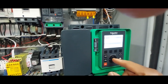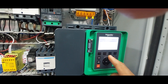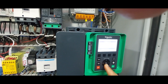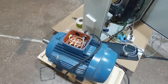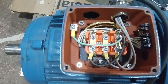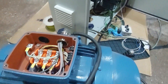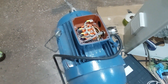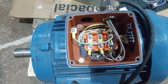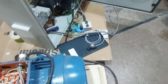We're going to run this on a start-stop configuration, so I'm going to configure the inputs and I/Os. For the motor connection, I've connected it to the inverter in delta configuration. You have to look at the nameplate — it tells you which configuration to use. This motor's nameplate says for 415 volts we use a delta connection.